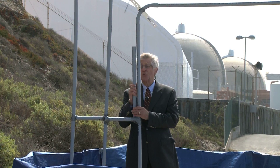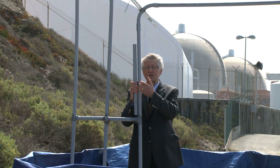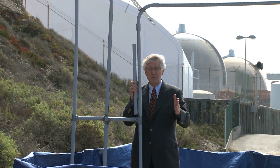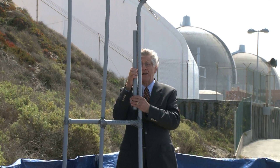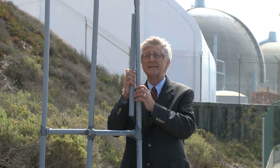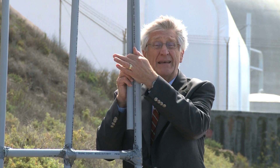In fact, they're incredibly close together, and there's a quarter of a million gallons of water squirting between these tubes every minute — 9,700 tubes on this side, 9,700 on the other side — and all of them have about a quarter of an inch of gap of water between them. The tubes are vibrating and hitting each other, and where they're hitting each other, they're wearing thin.